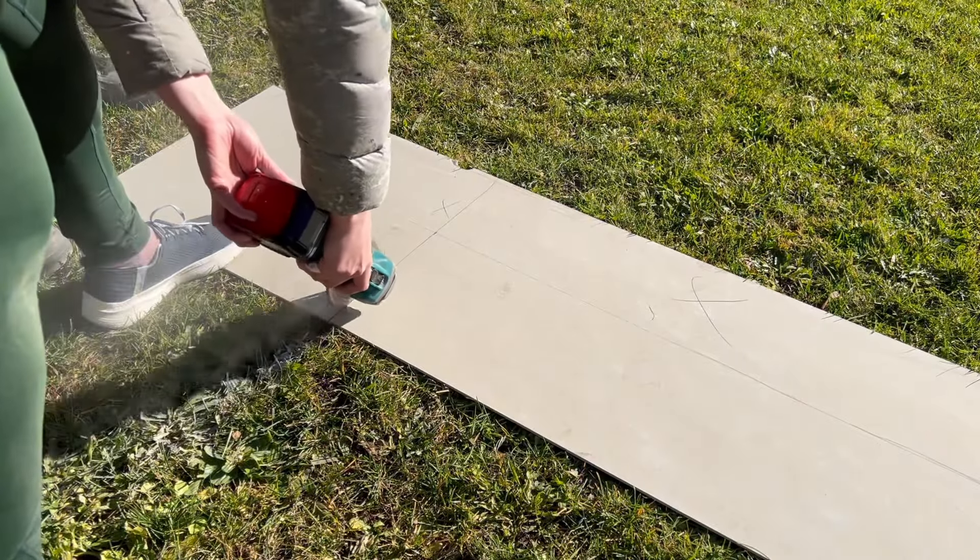I continued to work my way through all of the floor tiles — putting the glue on the ground, back buttering the tiles with the glue, and then installing them onto the floor. I would cut the tiles as I went, checking the measurements, then going out and cutting the tile and coming back to install it. In the main section most of the tiles were just full tiles, so I was able to lay the majority and then do a few cuts. There was a thin row of tiles that needed to be cut up along next to the vanity — I marked the measurements, got out the angle grinder, put a line across the measurement, and went back and forth with the angle grinder until it cut through.